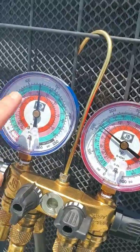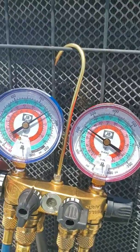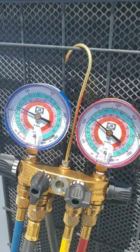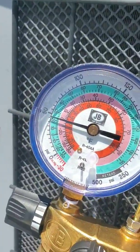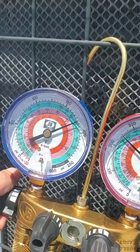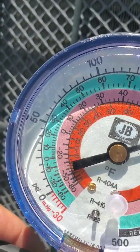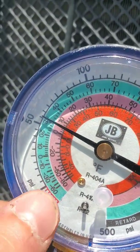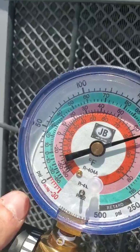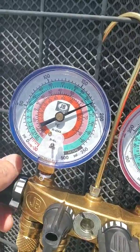You just open up your suction because your suction is actually sucking the refrigerant into the unit. You can see the pressure is climbing. We're just under 50 — we need to get it closer to 60 to 65, because you want a 40-degree evaporator coil temperature. That's where you want it. Anything lower than 40 degrees — if you start getting close to 30 or 28 — then it starts freezing up the coil. So you want it at 40.